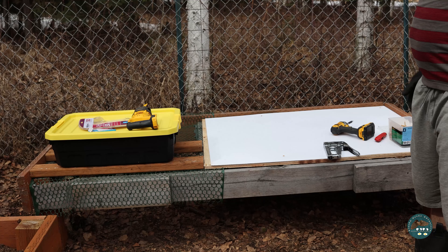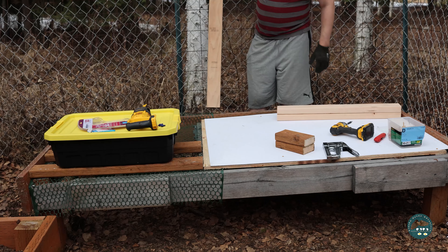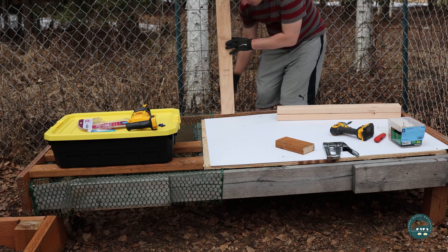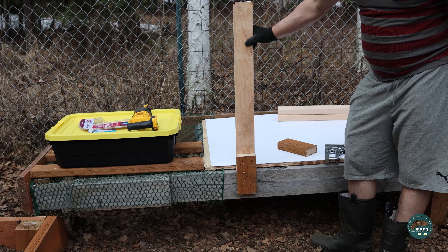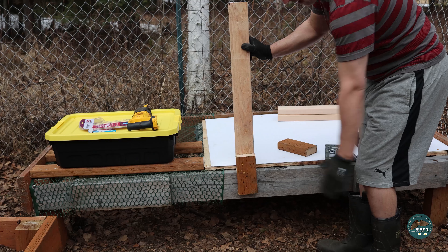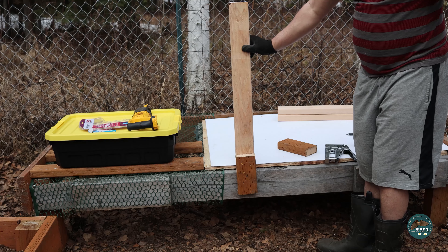Looks like we're about ready to start going upwards, so let me get some more lumber and start building the walls up to the roof. For the back wall I cut two at 30 inches and one at 31 inches — two on the backside and one on the far side of the sleeping area. The roof is 48 by 60. I'm going to take the longer pieces and put them flat on here, then I cut some seven-inch pieces for the back to provide support and drill it in. The weight will go straight down and then additional supports will hold it up. I'm still using the previous pressure treated wood I have.